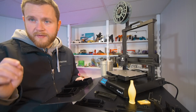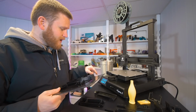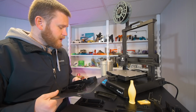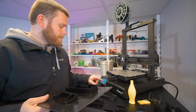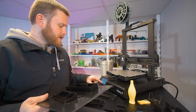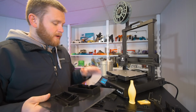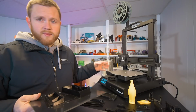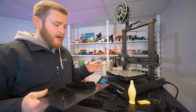And actually, one more thing that I'll do before that is I'm going to take apart the hot end because I want to see what's in there, especially because you can print ABS right from the printer at 255. So I'm definitely going to tear that down and just take a closer look. Another thing worth mentioning is the UI itself is very, very simple. There isn't much calibration you can do, if any. However, everything else seems to be really easy to do. It's fast, it's responsive, the touchscreen's nice. And the fact that you can hook it up to your machine, I know it's running Marlin, so we'll be able to send code through things like Pronterface or Octoprint if you have it, things of that nature. So technically calibrating this shouldn't really be an issue, but so far I haven't needed to calibrate.